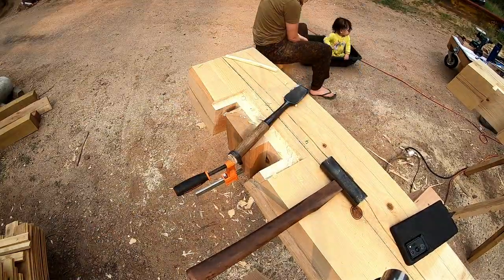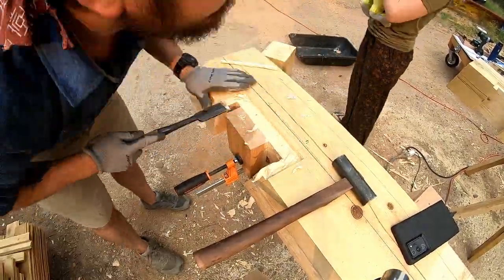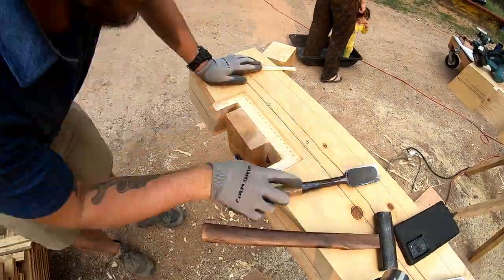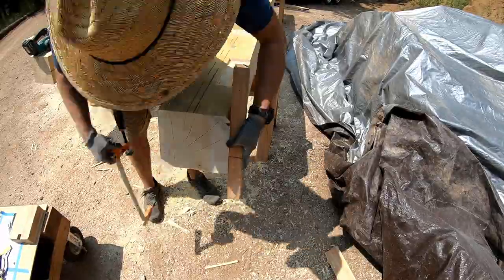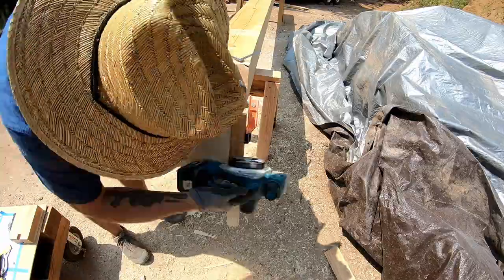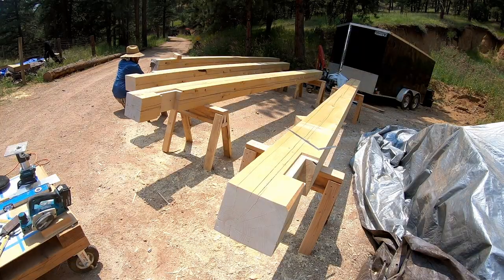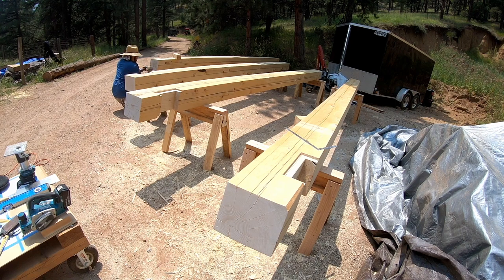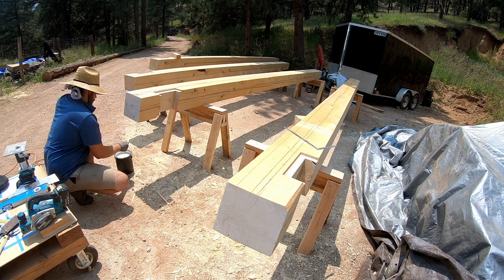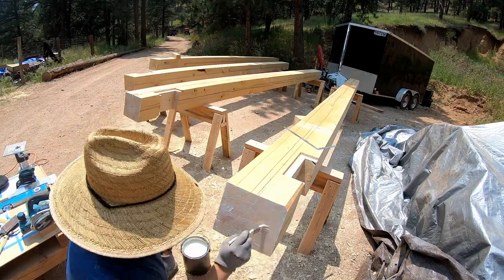Next, cleaning out the little seat pocket where the half lap joint intersects — that's just a matter of chiseling and cleaning up everything. I was so focused on this joint I did not even realize my daughter was over there in that concrete bucket playing with the sashagane, which I hope instills some life lessons in her. Very cute. Each of the ends were power planed down flat — that's why I have a board clamped to the end there, so that when the planer comes across it doesn't blow out the wood. These ends get the anchor seal treatment to keep the splitting to a minimum, although you can already see some checks, and the brutal dryness of Colorado weather is going to take its toll.